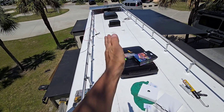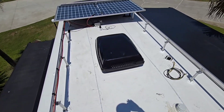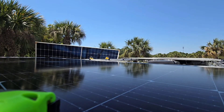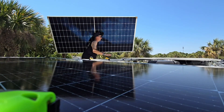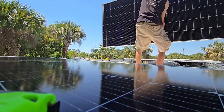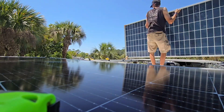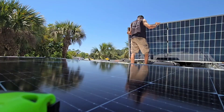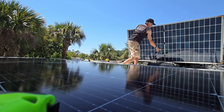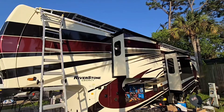Today mainly is getting the solar panels up and wired in place. The front two are wired already — the front slanted one and the next one are on their own solar controllers. Then I've got two groups of four behind that. I gave them the same lights I have on my rig — they're 24-volt lights wired right to the battery bank. These are Rich Solar 550-watt bifacial panels, the first time I've used the Rich Solar 550s — they seem to work very well. I can carry pretty much any size solar panel up by myself with an extension ladder, though these were about 62–65 pounds each, so you get any wind and it gets a little hairy crossing that roof line.